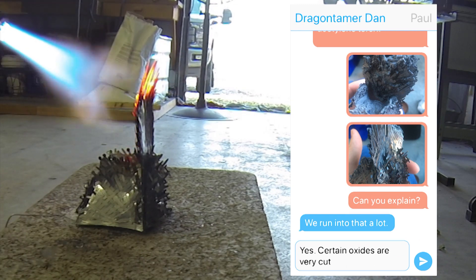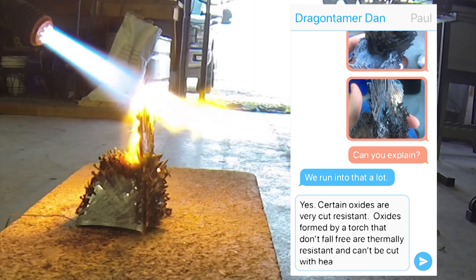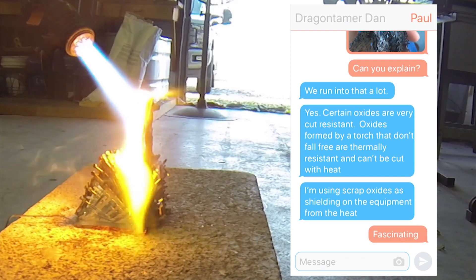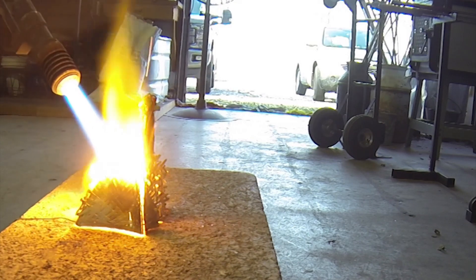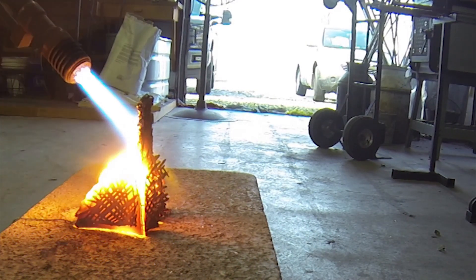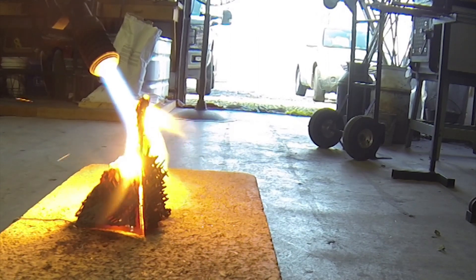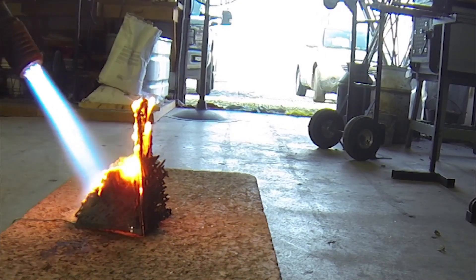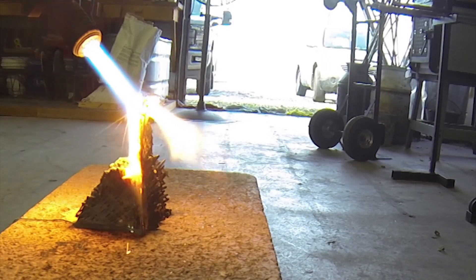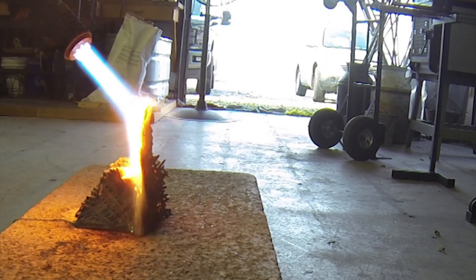I sent some photos to my friend Dan and asked if he could explain this. Dan works for a steel mill and immediately knew the answer. He said certain oxides are very cut resistant — oxides formed by a torch that don't fall free are thermally resistant and can't be cut with heat. He said he uses scrap oxides as heat shielding. Iron oxides take many forms. We've got iron, carbon, oxygen, hydrogen, nitrogen from the air. Standard rust, Fe2O3 — also known as iron III — forms slowly when iron comes into contact with water, and typically exists with lots of water molecules hanging onto it. But iron III can take other forms including hematite and magnetite, and it can be red, orange, green, or black. Some of these oxides are very heat resistant. There may also be other things present in the metal including chromium, nickel, copper, sulfur, and manganese — usually found in stainless steel or plated on the steel. The chemistry quickly gets very complicated.